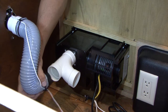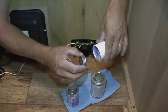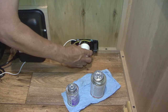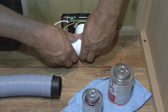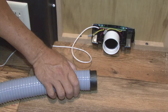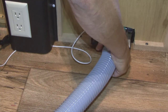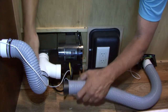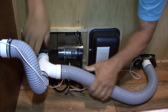Use the 45 degree T coupler to attach the existing hose or pipe. The coupler at the Vacport should be glued to the Vacport unit. Use glue to attach the opposite end of the elbow fitting and press fit the threaded coupling. If the elbow is not used in the installation, press fit a flex tube coupler directly into the pipe coupler. Connect the opposite end of the Vacport flex hose to the T coupler — do not glue this connection.